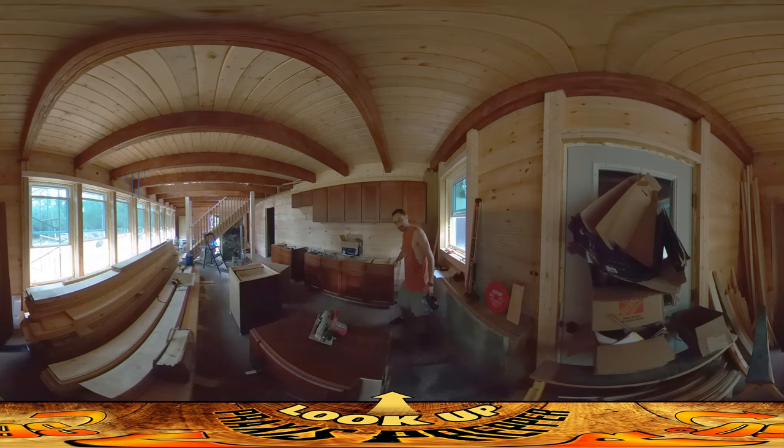I got a reading from here to the corner of this cabinet before I rolled it on its side, making sure I knew what height this corner needed to be. Then I fed off that measurement and figured out where I needed to trim. I've been ripping down this side a little bit because the floor is a little higher over here, and I'm pretty much there.